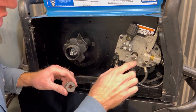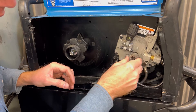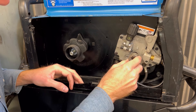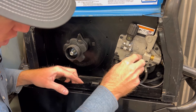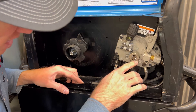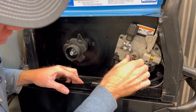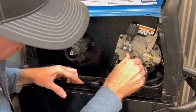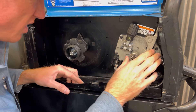Here's a close-up of the machine. My roller goes on right here — all you do is push it on. Every welder is a little bit different. Some bigger welders have a different way of doing it, but you're going to want to push it in and twist it. Wherever it lands is where it needs to go for this welder. I'm going to adjust it to the 0.030 wire, and that's where it's going to go.